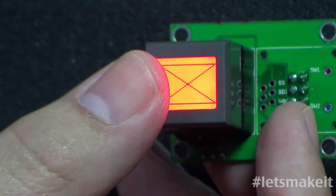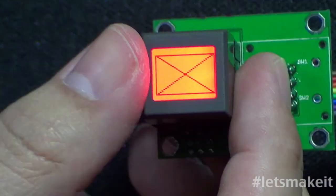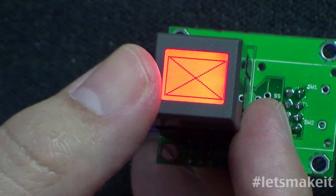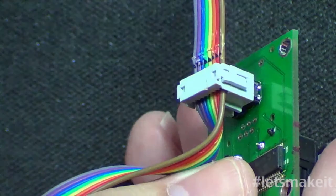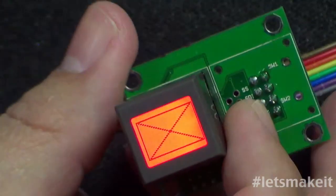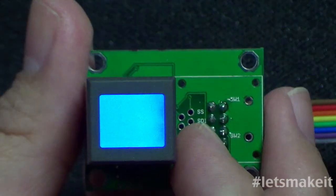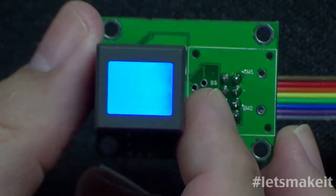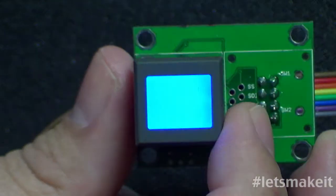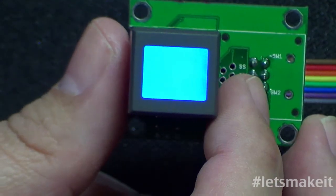Now this one has 2 switches on it. So 2 of those pins on that 16 are controlling switch select. So like I said, we're not using much of it. Now we are using 2 more pins because the way we're getting the push button back to the Arduino is we're using this 23017 chip. So when it sees a contact closure come across from pushing the switch down, it sends back an interrupt to the Arduino. That's how we know that a button is being pressed, is that 23017. So basically every switch that we have uses 2 of these. So using that one 23017 chip, we could technically control 8 of these smart switches off of that one chip. So you see, we're not using much of the chip for this one, basically using a quarter of its potential.